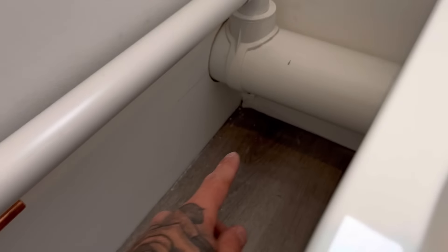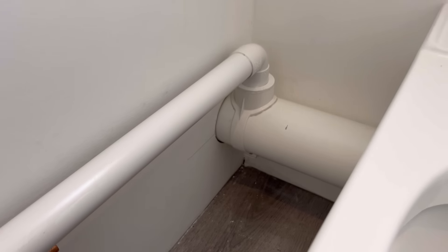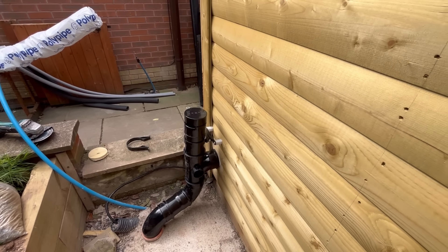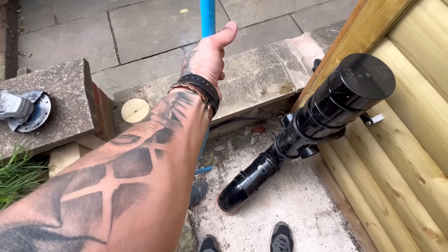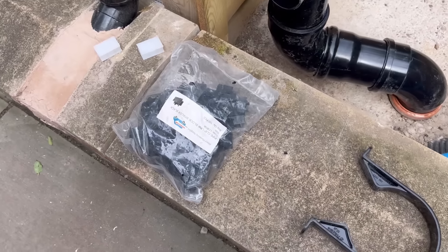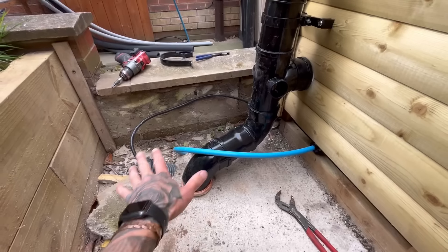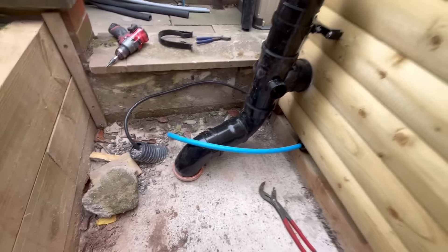Flexing off the toilet ready - so in this corner we're going to have a stop tap, a tee with the drain off on, and a tee to the toilet. We've got quite a bit to do outside. Moving on outside - I've just put some clips on there. Might take them off though because dad put them on and I've got black ones - this could look a bit better. I need to work out how to get this to inside and mess around with it up there. That looks a little bit better with the black ones. Talon don't actually make these black ones I believe - they only make white ones. The customer's just told us that he's boxing all this in. Straight into a Philmac fitting, spigot Speed Fit elbow up into copper and into the room - so all this is going to be hidden anyway.